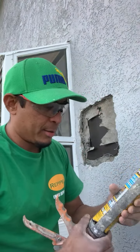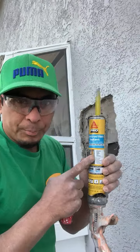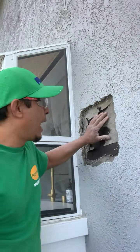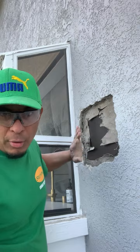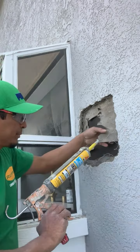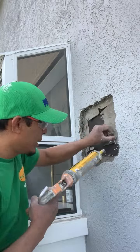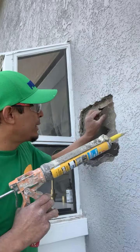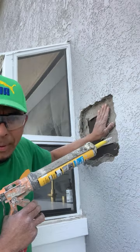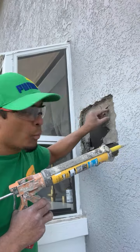I showed you in other videos before on my channel this kind of product, construction sealant. The camera is backwards. Like I do in this case, as you know, I make a surgery in both places, here and then here. At the bottom we don't need it, but I always put a little piece of silicone like this, just to make it close. And in this area, the most important is the bottom piece. The paper is on the inside, no problem, but just in case the water slides down in here, it will penetrate.